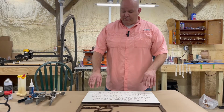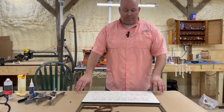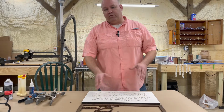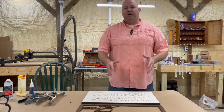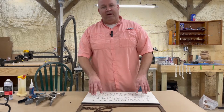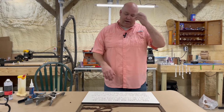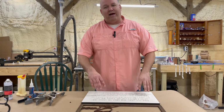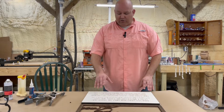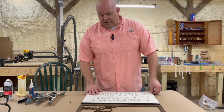We got all of the green tape pulled off of the bottom piece. And the reason we put it on the bottom piece and not the top is because when you're doing the engraving part of it, it tends to burn across the top. So when we put the masking tape on there, you can use painter's tape, any kind of tape, then the burn on the outside of it will stick to the tape. A little bit will get through in certain places, but where that did, we give it a light sanding and got that all cleaned up.